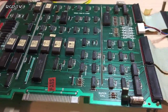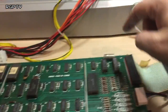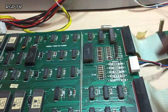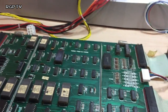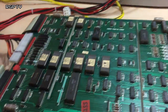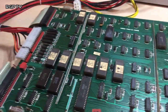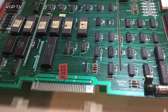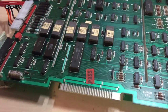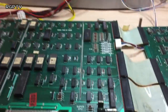Okay, seen a few Trons before. Hopefully this isn't going to be a stupendously long, convoluted one. The good thing is we are seeing a black background, which usually means that chip there, which is a pain in the ass to get hold of, isn't dead. Not seeing any other weird stuff go on, so I'm going to check the clock circuit's there, but the watchdog's going woof, woof, woof. So we will very likely just stick the Fluke on it, read the ROMs, read the RAMs, and see what's going on there. It could be stupendously simple. Well, we won't know until we start looking.